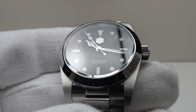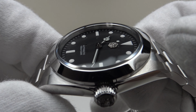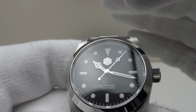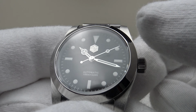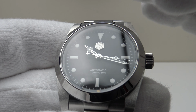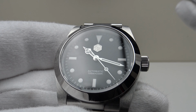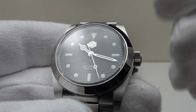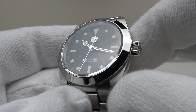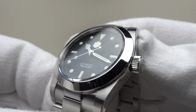The PT5000 is a higher grade of movement than the Seiko NH35A. As I've detailed, it's more accurate, the build quality is higher, the quality control is higher, and the quality of the materials is also higher. The other benefit is it runs at 4 Hz rather than 3 Hz as per the NH35A, so one gets a smoother sweep. It has a similar 40-hour power reserve, but the thing to bear in mind is that 4 Hz is the perfect compromise between power reserve and accuracy. I personally think that 4 Hz is a better balance between power reserve and accuracy than the 3 Hz used by Seiko as per the NH35A. So, better movement, higher grade, more accurate, better build quality, better reliability. So, yes, I consider it to be excellent quality, and yes, I consider it to be excellent value.